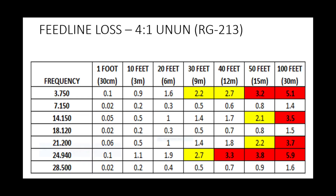If we compare this to having the 4-to-1 UNUN, we get a better result. Because we've matched the SWR better at the feed point, we have less loss. On 80 metres, for example, we've now got more acceptable performance. With a 50-foot run of RG213 going into the shack, you're losing about 3 dB — a lot of people can live with that. Don't forget, you've also got to factor in some loss in the UNUN and in your tuner as well, so maybe call it around 4 dB system loss.